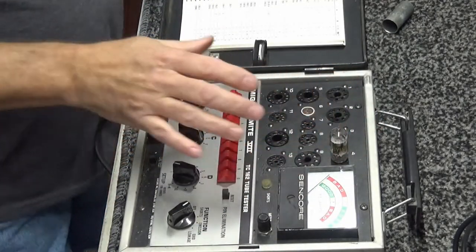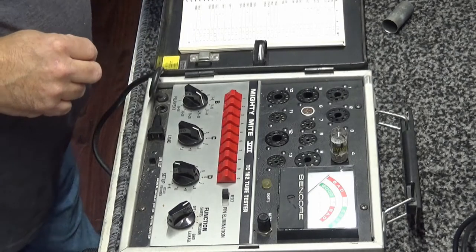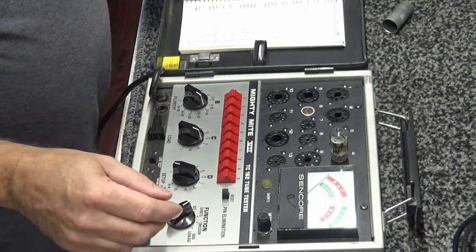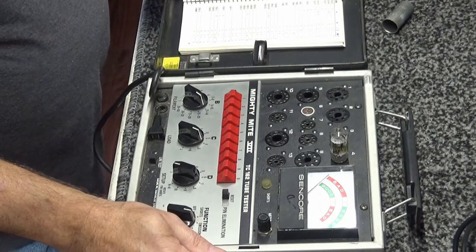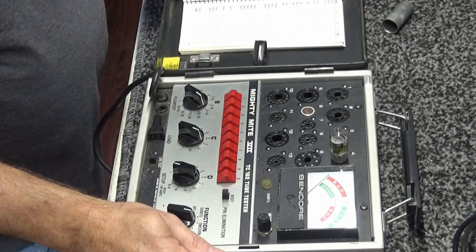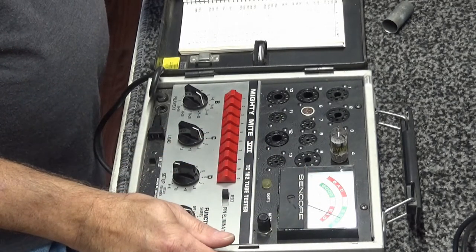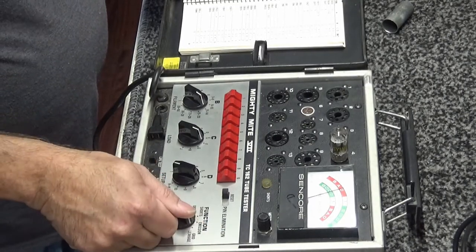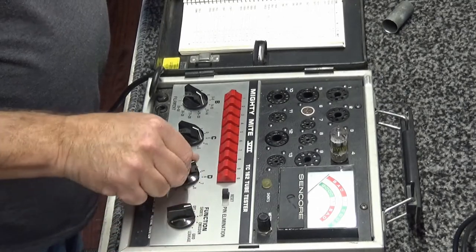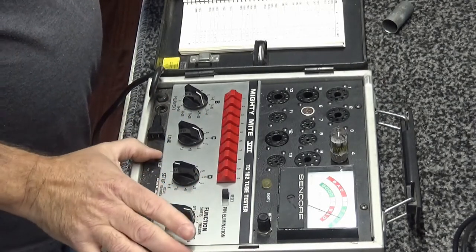There's three elements to this tube. So the 12AV6, that's why it has three listings here. I know you probably can't see it, but if you had the little manual there, it would tell you. Anyway, do emission. Tube's lighting. Knew it would be. Filament's coming up, so the emission has popped up. It's already almost to 100 on the numerical scale. No grid leakage, no shorts, no heater to cathodes. Back to emission, do life test.